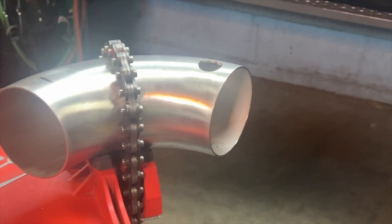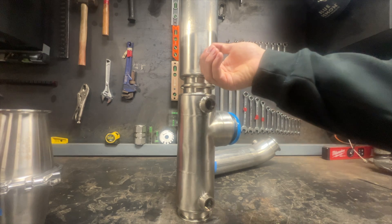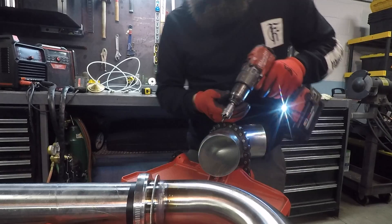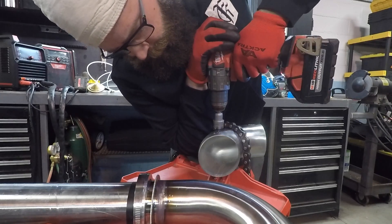When all of these pipes and fittings are installed, there will be hose jumpers connecting each one to the next. The hot water will fill up one jacket, go out the exit port, through the hose, and into the supply port on the next piece. The hot water typically flows opposite to the direction the product is flowing, because the product is hottest coming out of the tank and the hot water is hottest when it comes out of the supply.